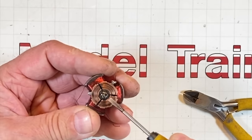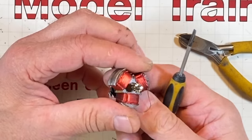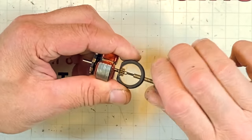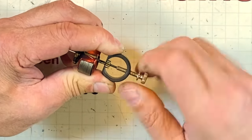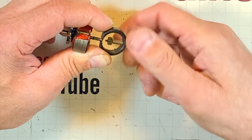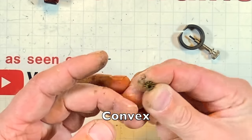I'd really like this commutator to come off. I think that gear has to be pulled off and then the whole thing will slide out. Maybe this little gear puller here - we're going to pull this fella off right there. It is not easy - you've got to have vice-grip fingers to grip on. That little fella's out of there. It's got a little bit of concave.